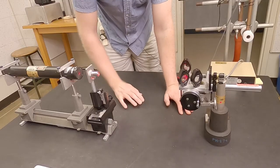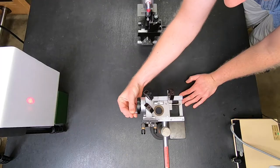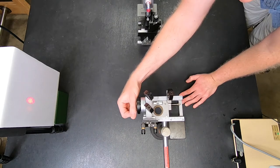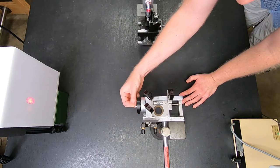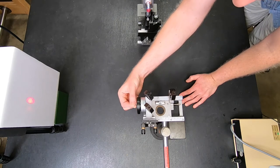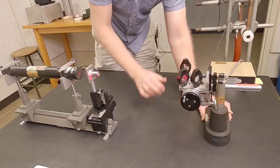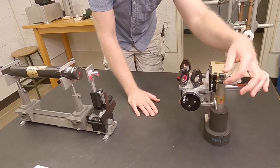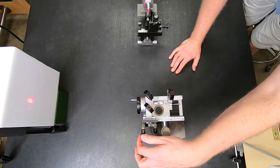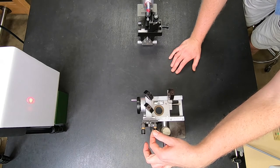So that's the operation of the interferometer. The things I can adjust are the path length difference — there's a ruler here marked in centimeters, and it's actually backwards the way the ticks go, so as I make the path length longer and longer, the numbers go down. Keep that in mind. The other two adjustments are the tip and tilt of this mirror, which affects the fringes — you can already actually see a little bit how that affects the fringes. I can center the fringes there.